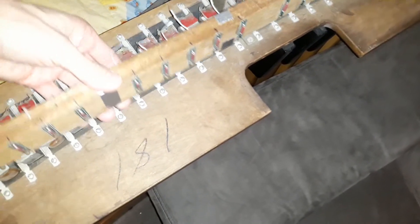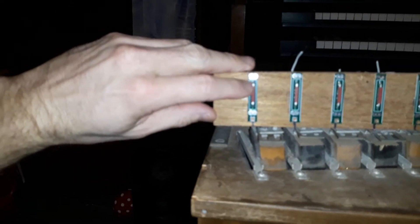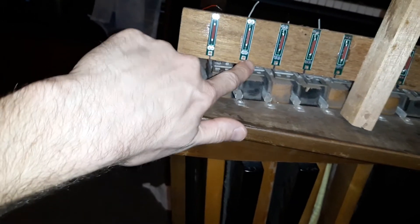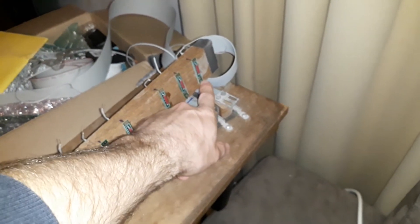Indexing back so that it looks quite neat and tidy. If I rotate this over, the plan is that each one of these wires will come over and be soldered — you can see the solder connection right there. This wire will be soldered on here, and then the connections on the bottom will be a common earth. I've cut a whole bunch of short sections of wire and we'll be jumper-leading them all the way across the entire length of the pedal board, with the common earth cable feeding back in at the end.